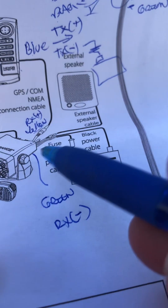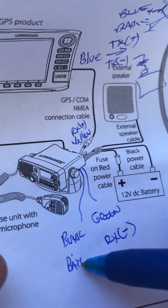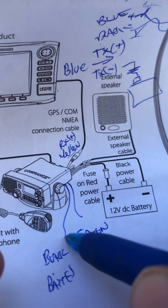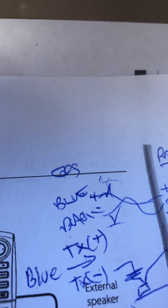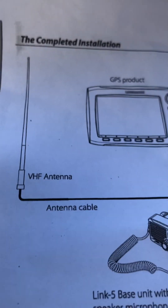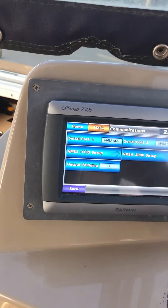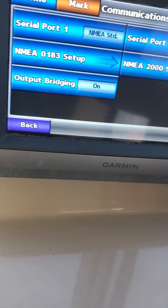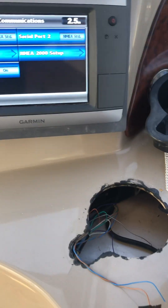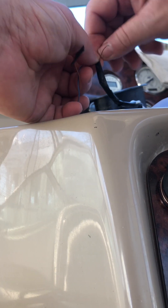Simple fix — out of my radio is out of my accessory cable. So this is just a cable sticking out the back — black, which was battery negative. It's a small wire; all I had to do was join those two. Thankfully I didn't have to pull the whole dash apart. So there's a blue — that's port 1 of my NMEA output, GPS signal output. So I put blue to blue and I'll just do this temporarily until I put a plug on it, just to make sure it works. Just twist those together.